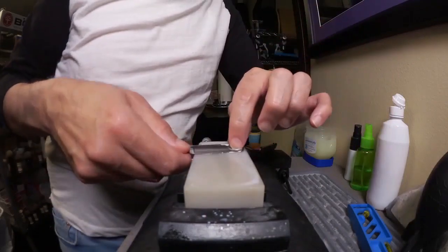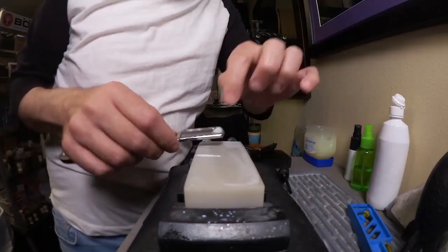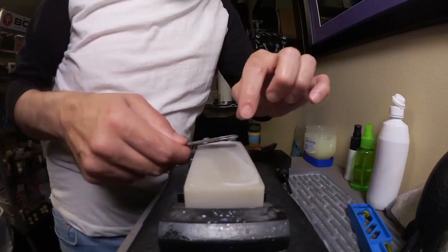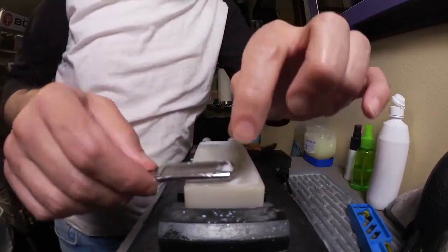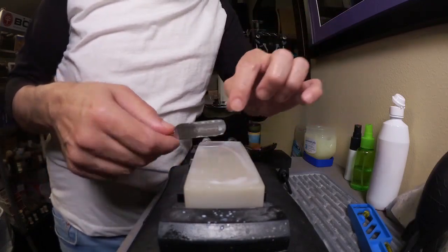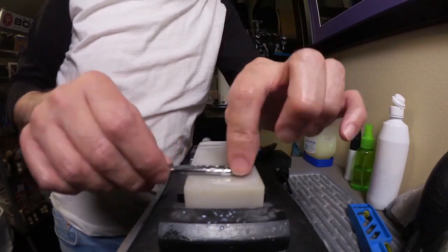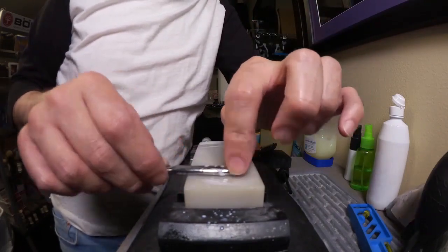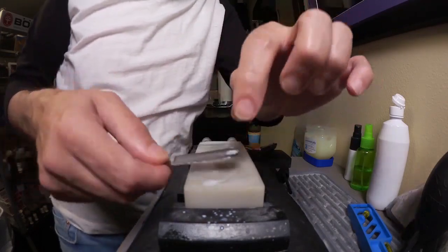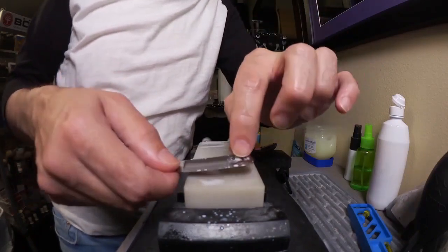So the white ones always retain a little bit of a biting cutting sensation, even though they're very fine too. They may not be, gun to my head, 1,000% as fine as the black ones, but because their feedback is a little more active and they seem to cut faster, I think they're better stones. Plus, if you ever go to sell it, when you have a white one you can show a picture of a flashlight glowing on the side of the stone, and that's a good benchmark to guarantee a minimum level of hardness.